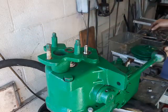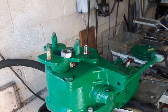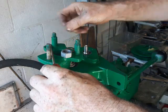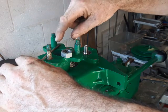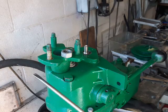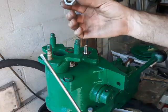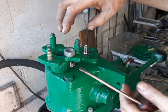When you've done that, fit your lock washer and nut. The way to torque up the nut is to put a big screwdriver or crowbar between the non-threaded bits of the nuts, and turn it with a 24mm socket. I use about 18 inches of leverage — that's probably about 60 foot-pounds on that nut. It's got a fine thread, so as long as it goes down smoothly it will be reliable.